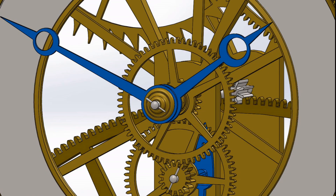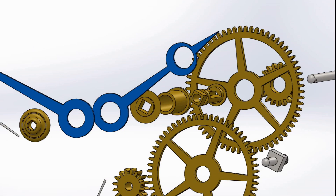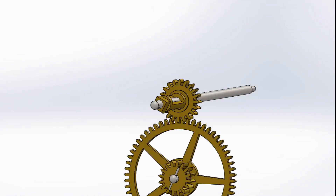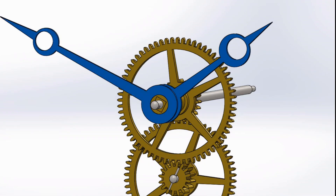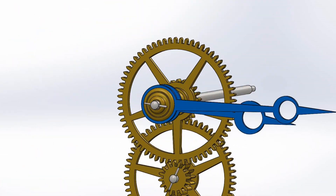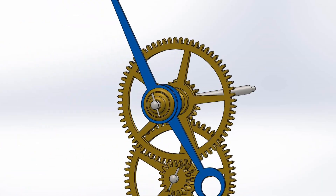This episode is quite a bit longer than usual, and part of the reason is that there's a whole lot of parts that go into making this sub-assembly. It's essentially a reduction gear train that takes the single hourly rotation of the centre arbor and reduces that by a factor of 12, so that the hour hand sweeps one full revolution for every 12 hours. It's a beautifully compact design that uses concentric sliding fits to great effect.